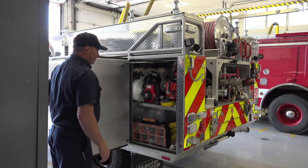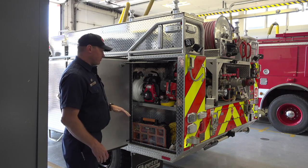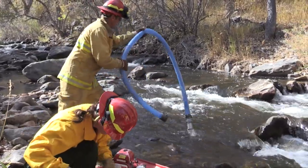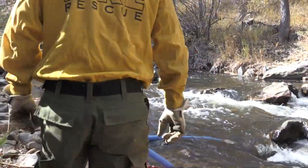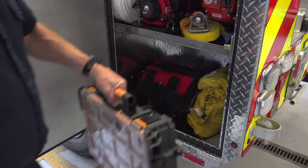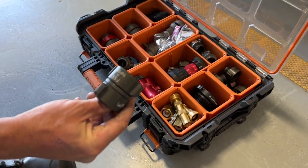In this compartment we have all the things that we need to get water into the truck or get water out of the truck. The 300-gallon tank can be refilled from a fire hydrant, or the truck is capable of sucking water out of a static water source like a stream or a hot tub. We also have portable pumps that we can use to refill the tank. The box is full of adapters, reducers, and appliances to either use bigger hose or smaller hose than what we have.